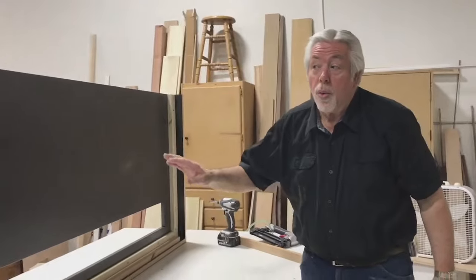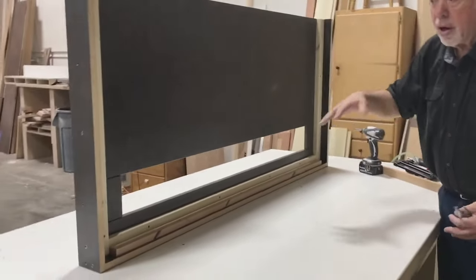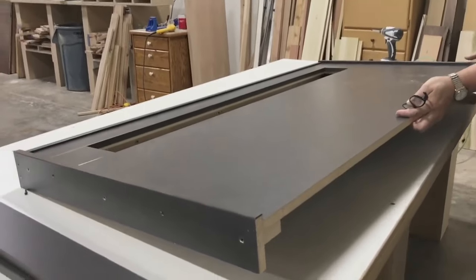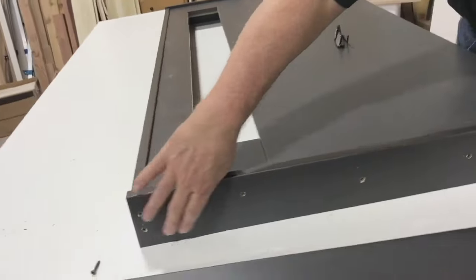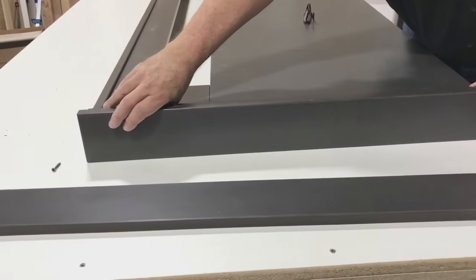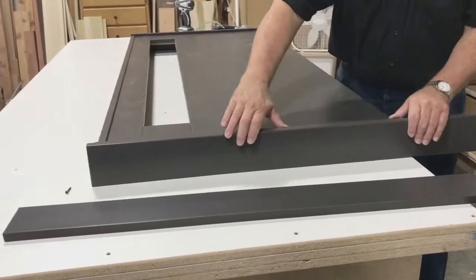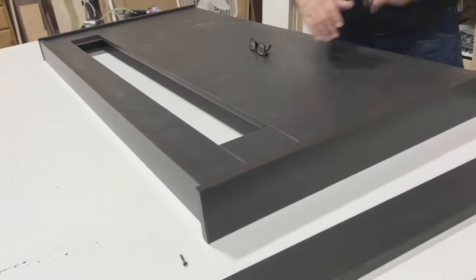Okay, what we did here was these structural pieces were to line up everything on the face side of the headboard and connect the little top that we put on it. As you can see, we now have the basic headboard construction, but we nailed and screwed through this layer, and we're going to put one more layer on the outside like this. That will complete our headboard just like that. This piece goes down over the rail that we built earlier. This is where our light feature goes, and we'll be putting that in next and putting these pieces on. But the headboard's coming together just right.